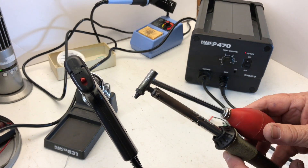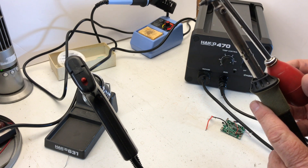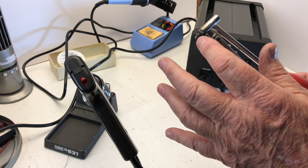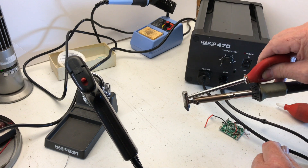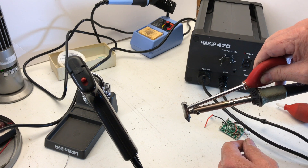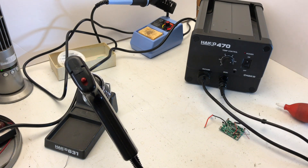I got a few more bucks and bought one like this. This is a desoldering tool — it looks like a pencil type soldering iron, but it has a little tip with a hole on the end of it. Same thing here: squeeze that, put it down on your circuit so that's touching. When the solder melts, do that and it sucks it up. That creates the vacuum.